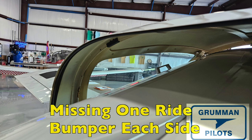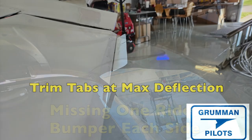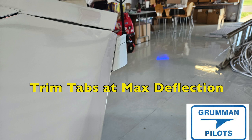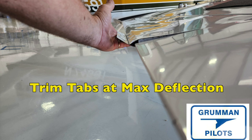All of this work on the airplane took about 90 hours: 25 hours for the annual it came in for, and then another approximately 70 hours for all the repairs approved by the owner. It hadn't received a lot of love in a long time. Looking at the ride bumpers in the back and the position of the trim tabs, we could tell the airplane was pretty much out of rig — both were deflected up to the max, which is 45 degrees. We had to rig the airplane.